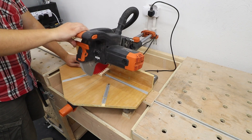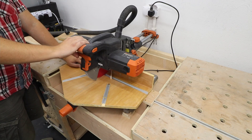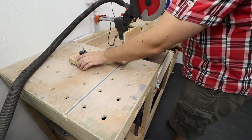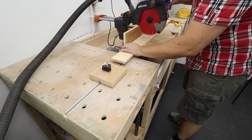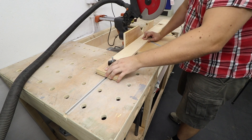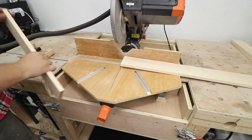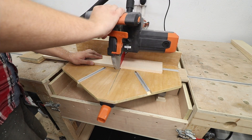Here I'm cutting off one end of all the boards so I've got one straight end, and I'm marking off how long the boards will be for the panel we're going to glue up. That panel will serve as the base for the whole table, onto which the chevrons will be glued. Having a stop block with the mitre saw helps with this, as the cuts are repetitive and the stop block makes it an easy job.